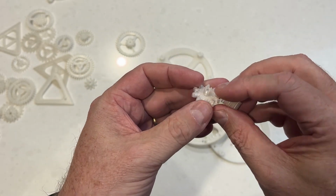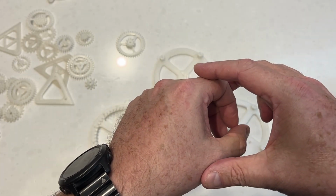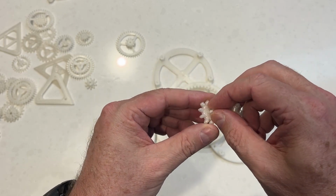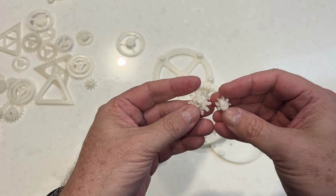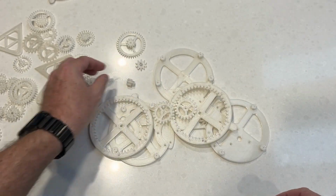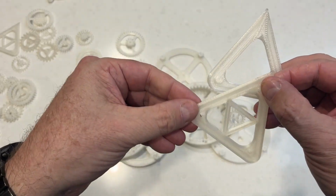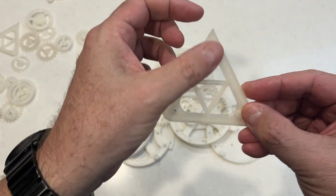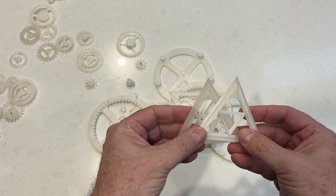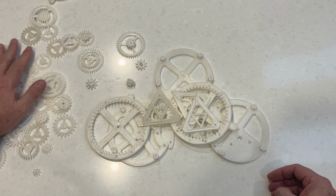So I found the best way of connecting was actually, if you just take a look at a nut and a bolt, and if you take the head of a nut, how easy a socket fits over it. And so that's why you'll see in future videos I use a 6-head shape, hexagon, and the other one fits over it like a socket would over a nut head, because I tried a few different methods of connecting and they would just shear off. As you can see, there was the very basic one. There was one over the carrier with a triangle, and there's another little gear inside. There's one with just a triangle. So when you design these things, you go through a whole lot of trial and error. I'll just show you how many prints were made.